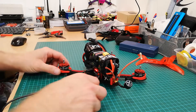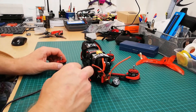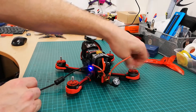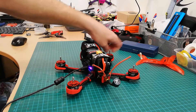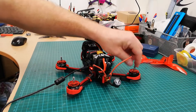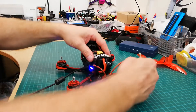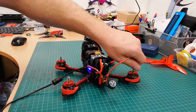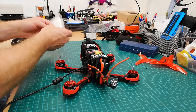Quick video on the phone — going to be doing a bit of hammering and banging but nothing major. Gary was talking about these VXC motors the other week; they're actually brilliant. I had a crash and it broke this arm — the back right or back left. When it crashed the nut smacked the ground, broke the prop. It was quite a big smash on the tarmac. The bell seems fine but there's a wee bit of noise in the motor — feels like grit. I've had the motor apart; it's in the bearing. Got a new set of 10 bearings to replace them.